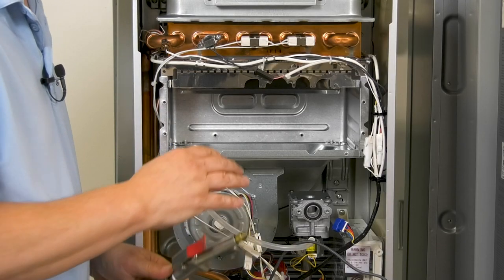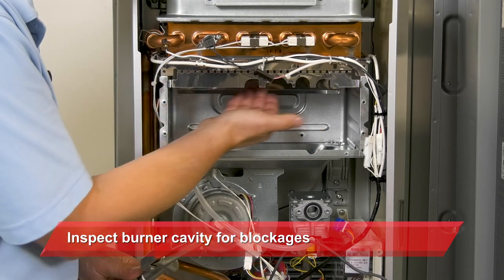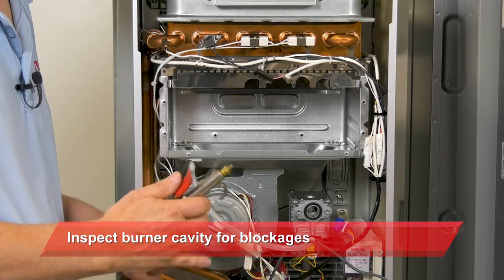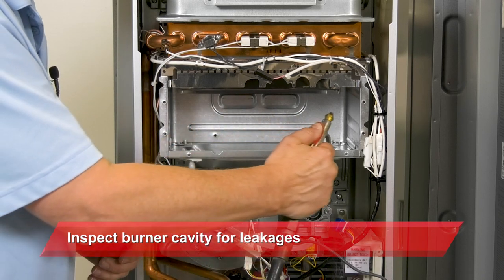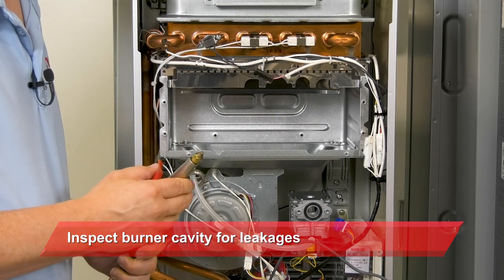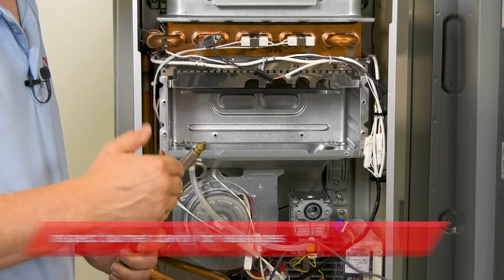You'll also want to inspect the area where the burner was. Look down where the fan is and also look up inside where the heat exchanger is — you're looking for any blockages. You can use compressed air if needed to blow through this area. Also inspect for leaks. Leaking heat exchangers are usually due to bad water quality or possibly failure to drain condensation in the vent system.